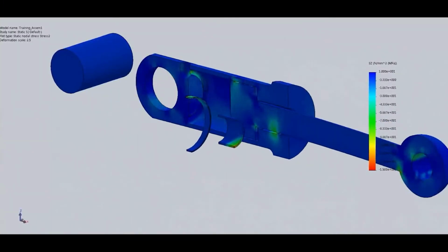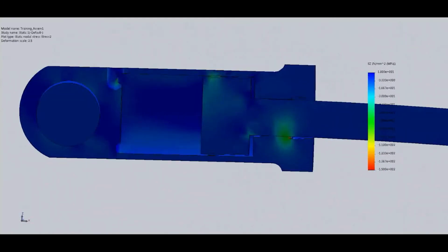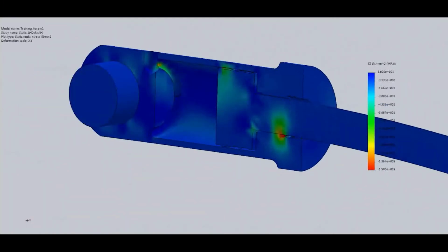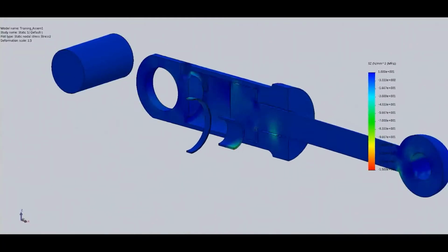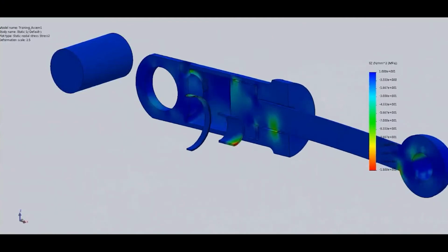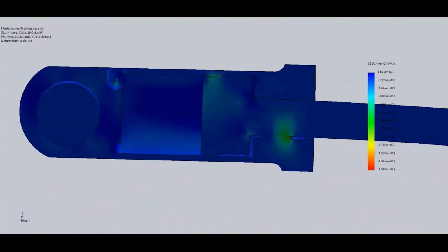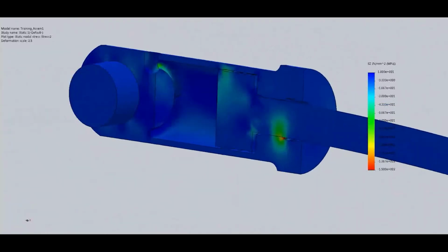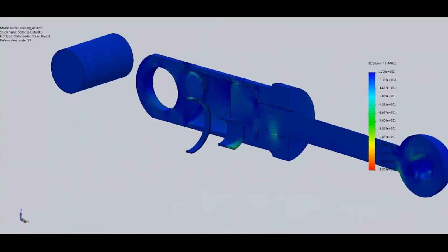When a cylinder is retracted, it has the highest resistance to side load, not only because the torque effect is low when the rod extends a little past the rod bushing, but because the other end of the rod is supported by the piston deep inside the cylinder bore. As the cylinder extends, the moment arm extends as well, increasing the torque potential on the rod, as well as moving the piston closer to the head. This reduces the capacity for the piston to act as a bearing.